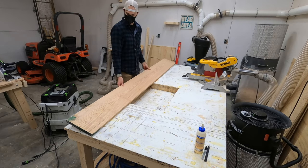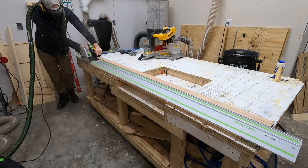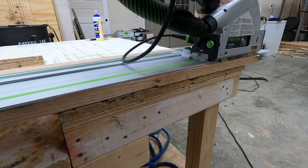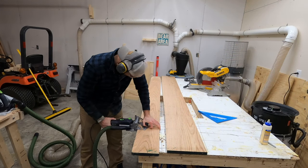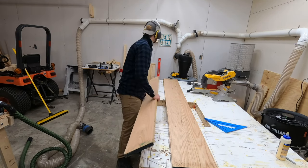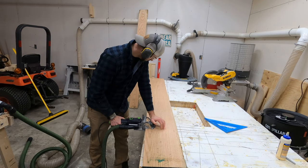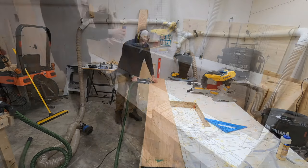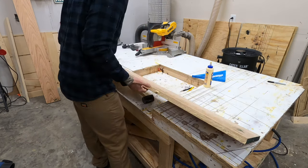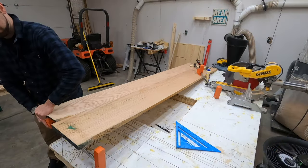With the legs finished up for now, we shift focus to the rails, footboard, and headboard of this bed frame. The process for each of those pieces begins with some rough-sawn red oak — boards a little over an inch thick — and we'll plane everything down to final thickness a little later, but for now we want to leave them as thick as possible. Because the main headboard was almost 20 inches wide, I had to join a couple of boards together. Looking back, I wouldn't have bothered with dominoes here since I'm running this through the planer, but I did use some dominoes just to make sure everything was aligned during the glue-up.